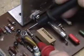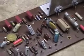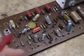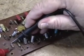Here's one that's really important: it's a 10 ohm resistor used in the power amplifier to adjust the bias, and it reads 20 ohms — that's double the value it's supposed to be. This is an example of what can happen to these components. Not only do the capacitors change in value with age, but the basic resistors themselves are no longer accurate.